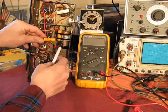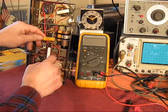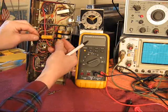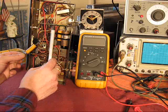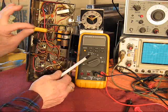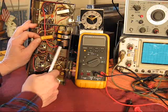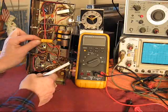Doubt if this will focus enough, but they're Sprague Atoms, 30 microfarad, 150 volts. These were made in 1989. I've got some as old as '79. They're new old stock, and every single one of them works just fine. If you can get your hands on a bag full of these, do. Just about all of these AA5 radios, if the electrolytics in it go south, put some of these in. It's not critical. If it calls for 50, use 30. If it calls for 20, use 30. Don't worry about it. 150 volts is plenty for one of these hot radios.